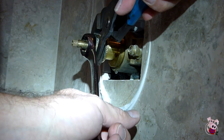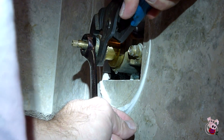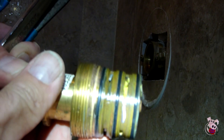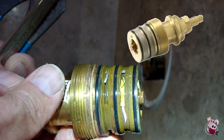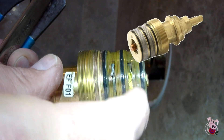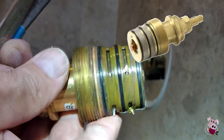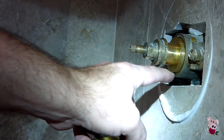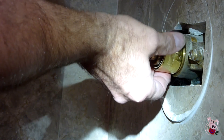In this particular shower, we were getting only hot water and couldn't make it very cold. When we took the valve out, the first thing we saw is that it was all clogged and the screens were missing — so we don't think we were the first person to take it out. The screens look stainless steel, so I don't think they rusted away. The valve was full of debris. We cleaned all the debris out and pushed the springs back and forth inside, but putting it back in did not fix the problem. So we ended up buying a new one.